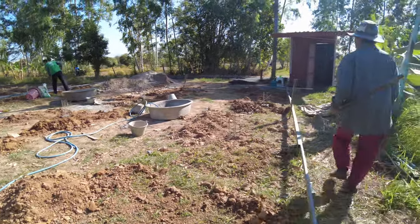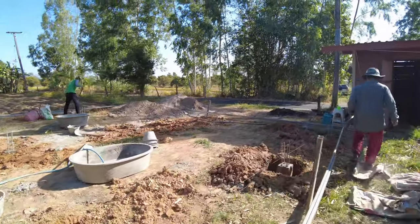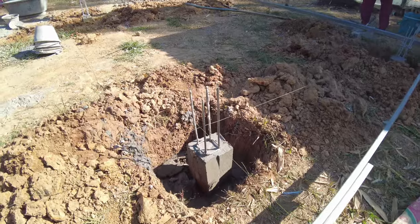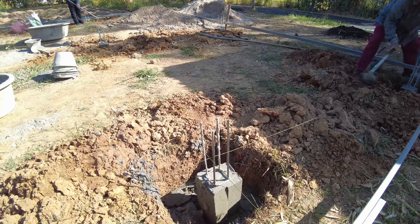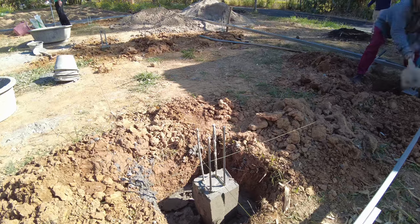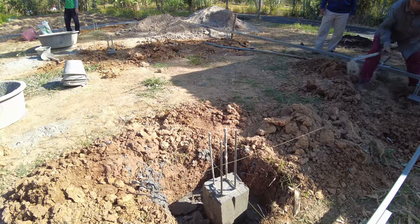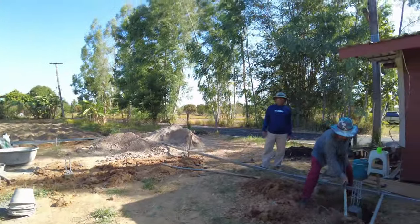You can see the steel work sticking out of the ground. They dug their holes, put in a concrete pad, got them all to the same level, plumbed it, then put in a steel reinforcement to centralize and square it. Then they built some wooden box work around the lower portion and poured the lower base of the columns. The columns are going to be steel.